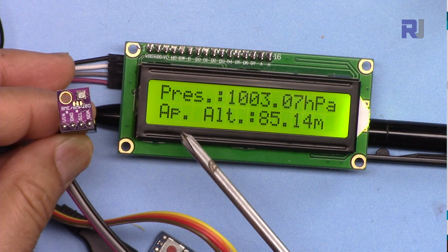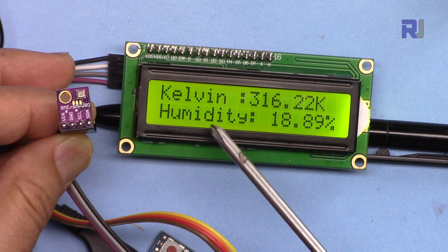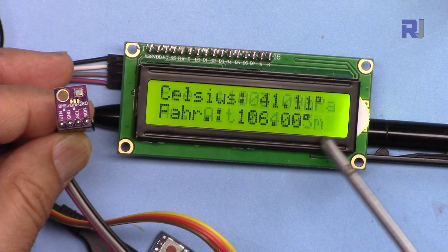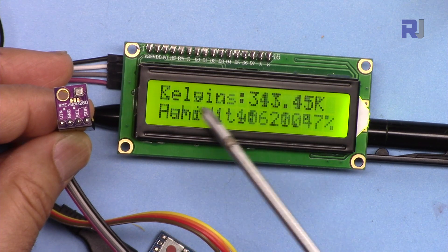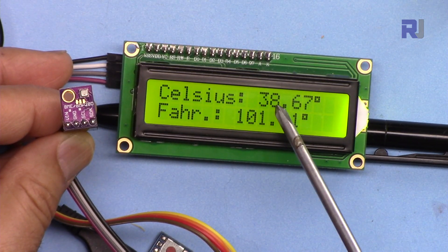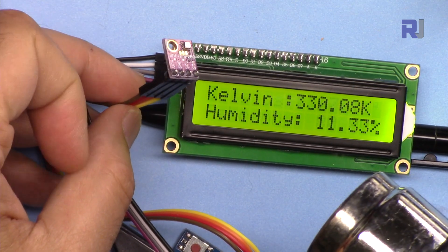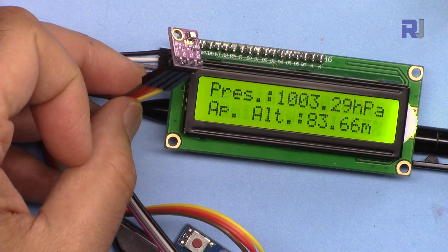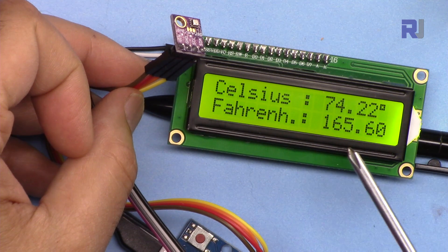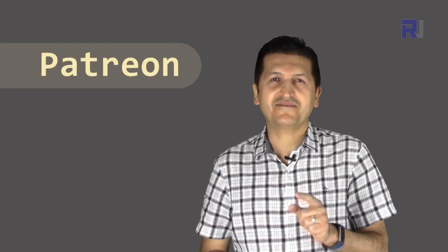Here's the demonstration. It shows pressure in hectopascal, approximate altitude, degrees Celsius — currently 44 degrees — Fahrenheit, Kelvin with 'K', and humidity with percent. Everything looks correct. The altitude may show one extra digit if the value is larger, so the title text may need to be shortened. Since the sensor maxes out at 85°C, two digits always fit fine for Celsius and Fahrenheit. Here we can see 74 degrees Celsius displayed, and the value shifts left as expected.